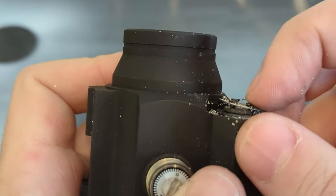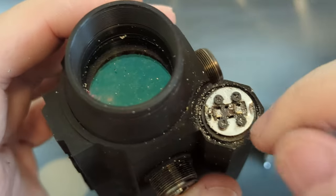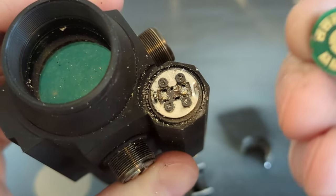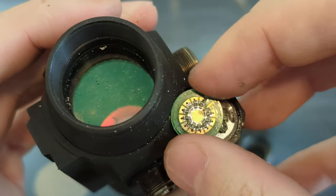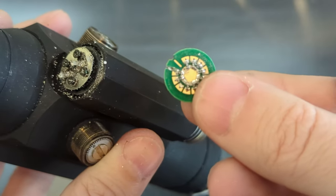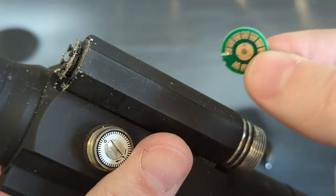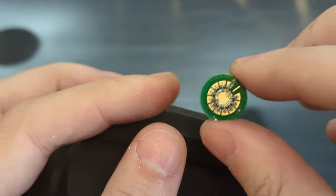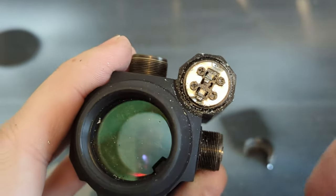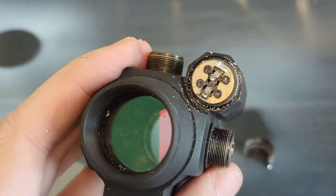There are your two contacts — right there in the middle and right there on the edge. As you rotate that knob, these two contacts stay where they are and you're rotating the PCB, just running the circuit through a series of little resistors. These resistors cost a fraction of a penny — all the resistors on this thing might be a penny in quantity. Very small PCB, very simple resistor network. So if there's more control circuitry, maybe it's behind this — that's the next step.